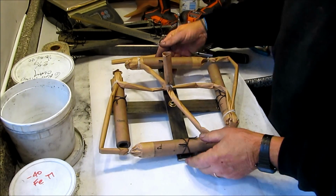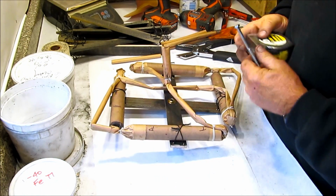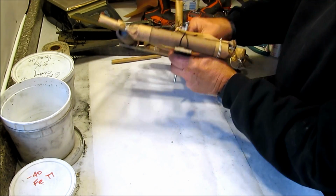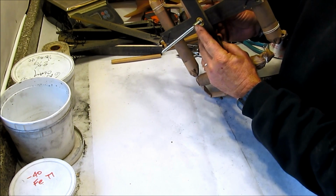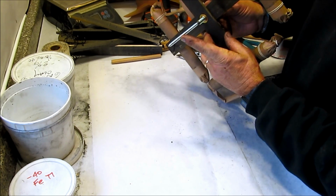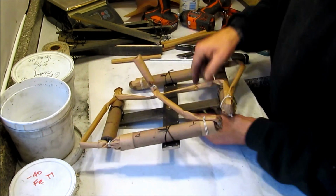Well, there's the little wheel I'll put in the center. I'll use a longer bolt, I think this is a 6-inch by 1/4 inch lag bolt, yeah, 6-inch. I'll use a longer bolt in the center that goes through this 1.5-inch hub, and then through the 3-inch hub of the larger Chromatrope wheel, and then 1.5 inches into the support. And so this will be bolted right into the center of the front Chromatrope wheel.